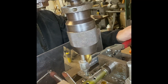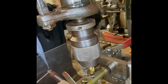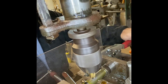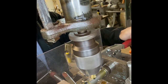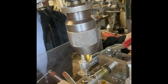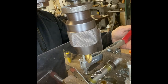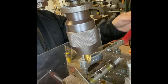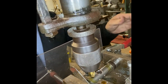It's really important not to rush when you're trying to drill through Monel. If you start to push and you don't let the cutter work, you'll get some pretty terrible burrs that you have to clean up — that's inevitable anyway.